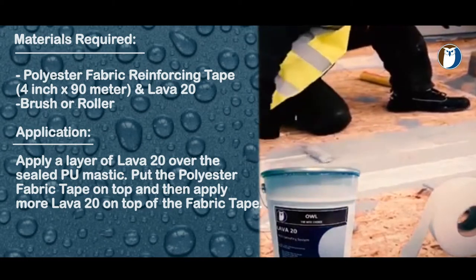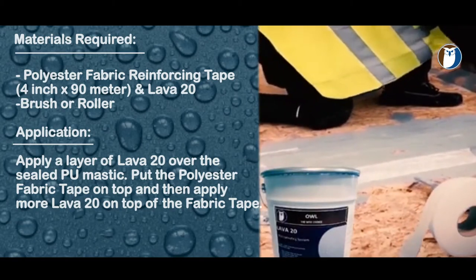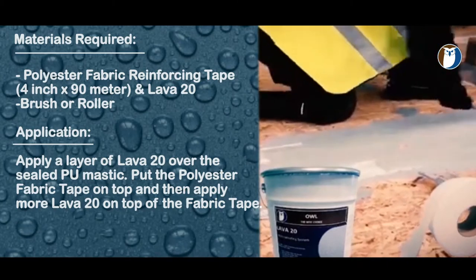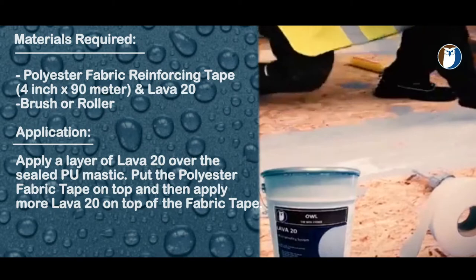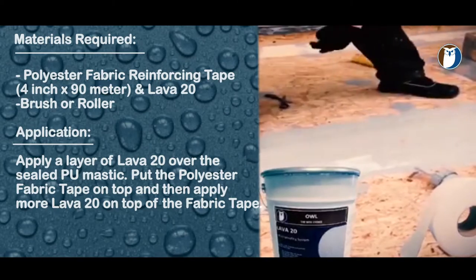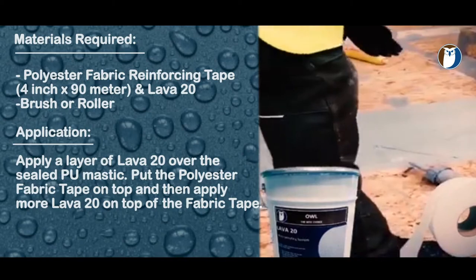You will then apply more Lava 20 over the entire area. This will complete the joint reinforcement. The benefit of this tape is it is a fully liquid and chemical bond, which means it is low lying and does not have a high profile, and it has excellent adhesion. Once applied, these joints will hardly be seen in your new roof.